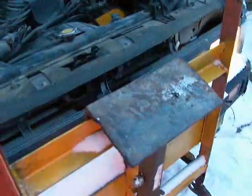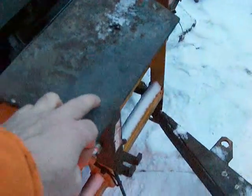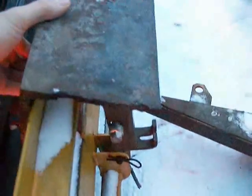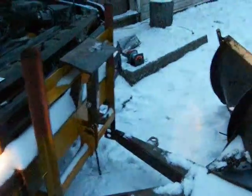I need to drill two holes through here, use the torch, and weld it on both sides to give myself something to mount it on. But I can't have the cable hitting anything, so I'm going to tilt the plate a bit so the cable doesn't rub. You don't want to rub the cable — it'll fray and cut through eventually.